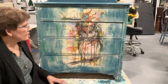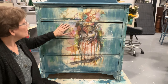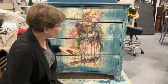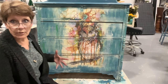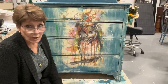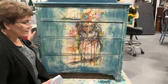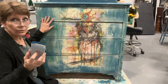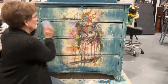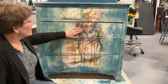Now I'm going to lightly sand it. When I added all that water, there were some spots of the decoupage paper that bubbled up a little bit. If you leave that it will go flat again — it's just some of the paper stretching. However, it might mean some of the glue has let go, so lightly sanding might give me some wear spots here and there, which I'm okay with. I'm looking more at distressing — it doesn't need heavy distressing because it already looks distressed. I just want to smooth it. All those layers have a little rough texture, so I have 220 grit sandpaper wrapped around an old sanding block, and then we're going to start waxing.